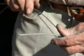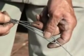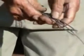To create such a knot, a shorter length from a different coil of wire is used to create what looks like a little hook. When brought together, the little hook is inserted through the bent legs of the binding piece. The binding piece is lifted over the short leg of the hook so that it rests on it for support. The short leg is then bent inward and lifted over the binding wire and pressed through the binding wire loop.